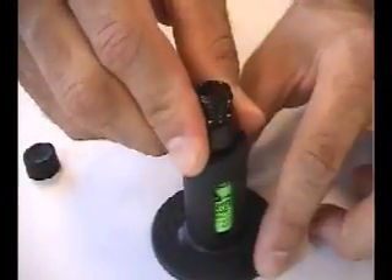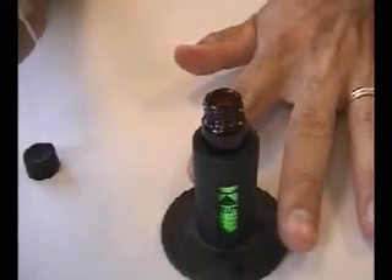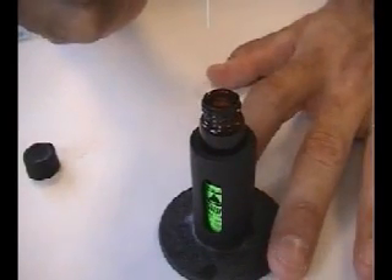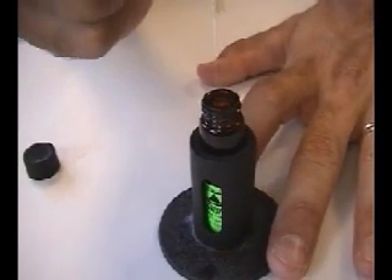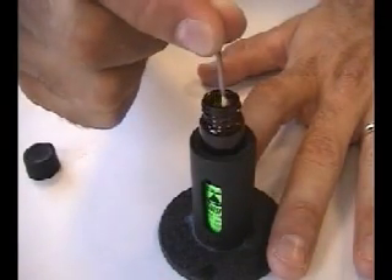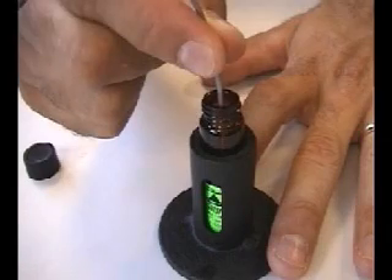With the Lightspeed primer mounted in the stand, dip the entire exposed fiber into the primer and place in a protected area to avoid contamination and damage. Be sure to coat the entire exposed length of fiber including some portion of the buffer coating to ensure a proper bond. Do not be concerned with keeping the Kevlar strands out of the primer solution.